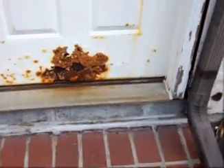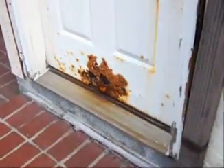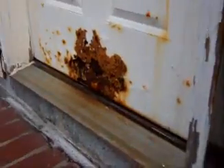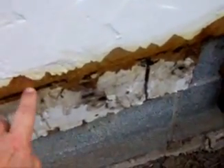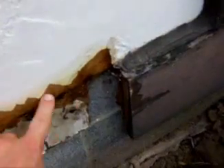This was another thing that needed to be done. It's a steel door that's 30 years old and looked pretty bad, and last winter woodpeckers were banging away at some bugs back there and really busted it up. Here's some stucco board I took out — this part has now been glued and is up to the gluing step I described. You can see it's practically like fiberglass. Once I prime that and get the new trim on there, that's going to be around for a while. I should note I screwed up — there shouldn't be this much of the underneath part showing. I wasn't paying attention when I took off the trim and busted up more paint than I should have. Just got to be careful how you pull it off.